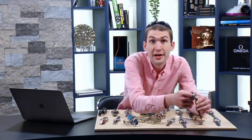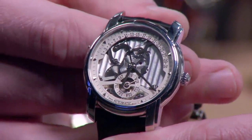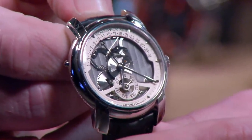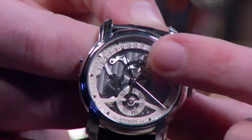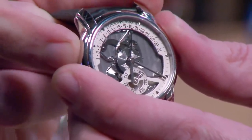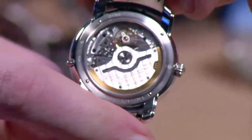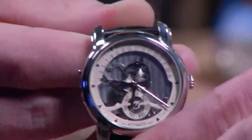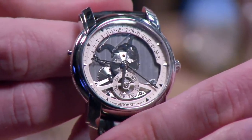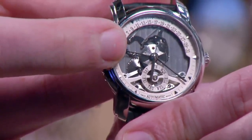The finale: a watch I cannot top — made in 2002 in 247 copies for Vacheron Constantin's 247th anniversary. The platinum 37mm retrograde day-date: freehand engraved ratchet wheel for the jumping system, black-polished ratchet pawl for the jumper, a brilliant pusher adjuster on the flank that frees you from using a pencil to set the calendar. Gloriously hand-finished and visible. Caliber 1126 — a Jaeger-LeCoultre 889 base with Vacheron's own retrograde date module. You don't often see straight graining on dial-side plates, freehand engraving, and black polish alongside Côtes de Genève all on one watch — but here you never have to take it off.